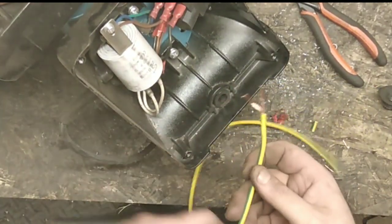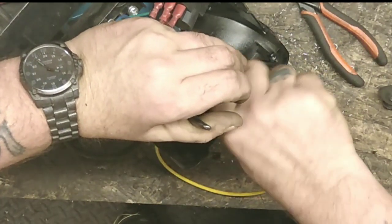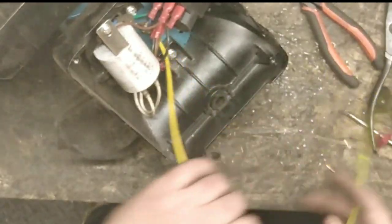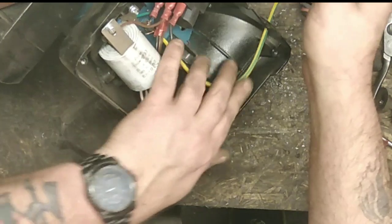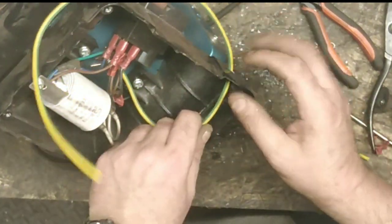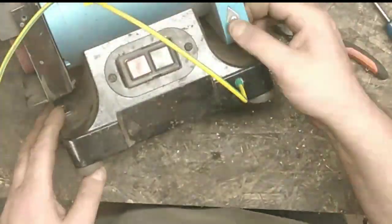Okay, I've spread these open. I'm going to put that underneath the washer that I've loosened from where the earth comes in, so that everything's all joined together. I've got a lack of rubber grommets, so I'm just working out where this will pass through the body, and I'm wrapping a thick old bit of tape around it. Keep it in place, stop it vibrating, stop the body cutting through the wire plastic covering.